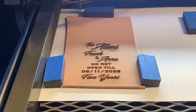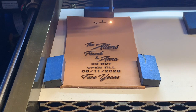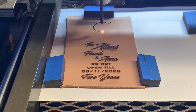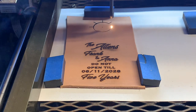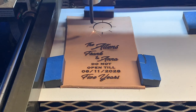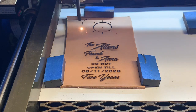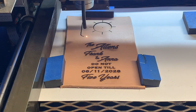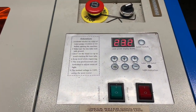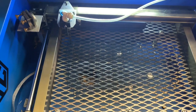Okay, we're back to the view inside the laser. Make sure if you're filming videos like this that you are safe — this is a CO2 laser and it will burn you if you get your fingers in there, so stay safe. This is a file I designed in CAD. I bring my CAD files into Inkscape, convert the paths to cut lines, and save that as the LaserDraw LYZ file. I'll drop a link in the description for the LaserDraw converters for Inkscape. This is the standard K40 with the regular controller — without the Ruida controller — and you can do a lot with this machine once you work through a couple of hurdles.